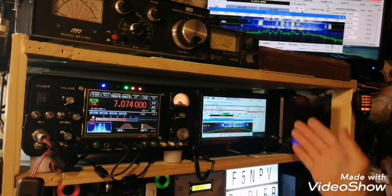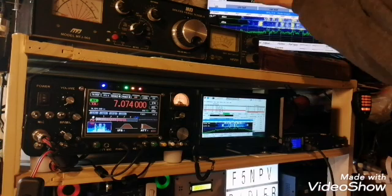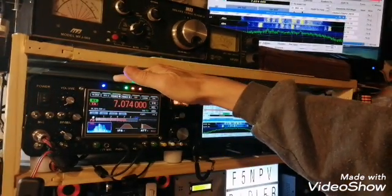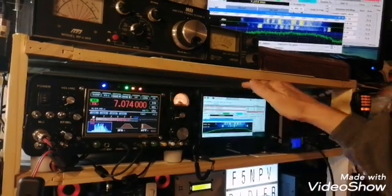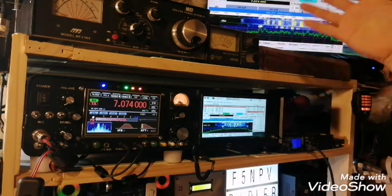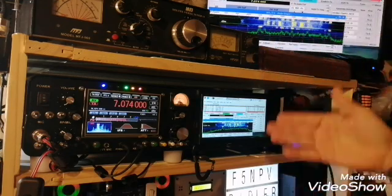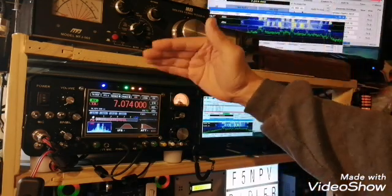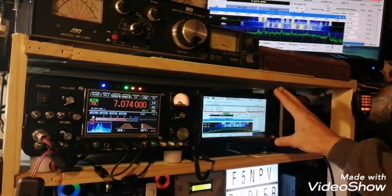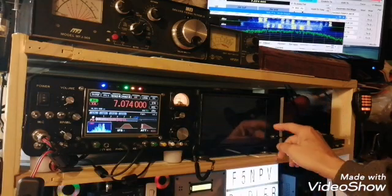The front panel is very basic because everything is at the back. At the back of the UBTX I have a DB9 plug, and I also put a DB9 plug so the LPF filter, the transverter, and the HF amplifier are controlled directly by the UBTX. So I just need a switch for the display — that's all.